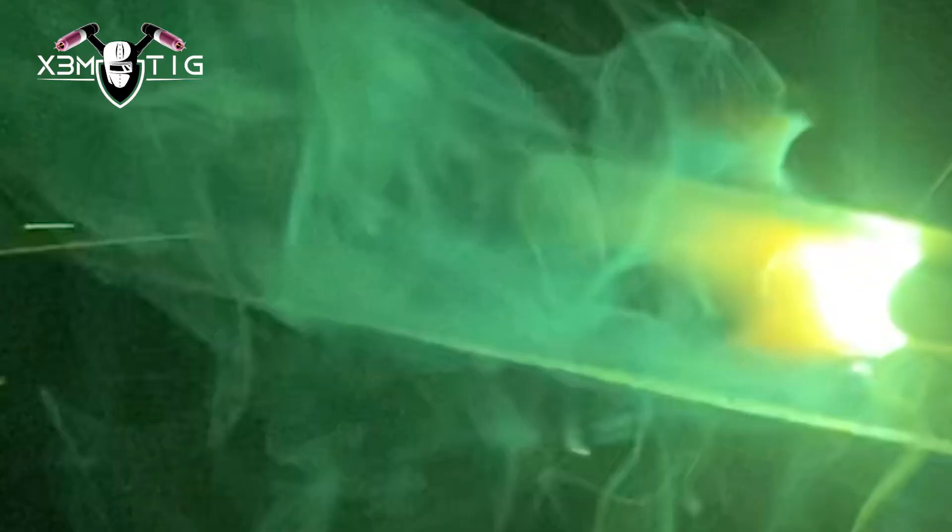As you can see here, there's not much manipulation — just rod inclination. The rod angle just leans between that edge and the backing strip and lets it burn by itself. It's a pull technique. With that amperage you should be good from the beginning all the way to the cap; you shouldn't have to change anything.